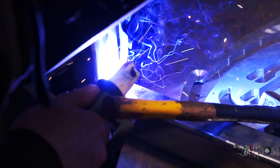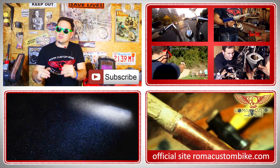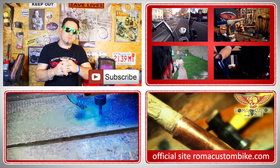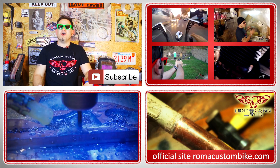So now I can say that for heavy structural work I still prefer the stick welder — it makes for rugged welds on thick plates. To weld thin sheet metal, like the stuff we've seen in the Speed Triple project, the MIG welder is still my preferred choice. Last but not least, if you have the skills like Paolo for welding aluminum or for very controlled welds, TIG is the way to go. If you've made it this far, it means you liked the episode — please click the like button, subscribe to the channel, and share our videos. Visit www.romacustombike.com for our custom handmade accessories and show t-shirt. I'm Custom Cez and this is it for this episode — see you in the next one!